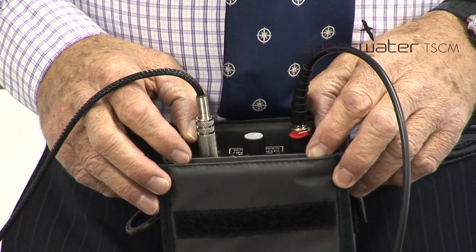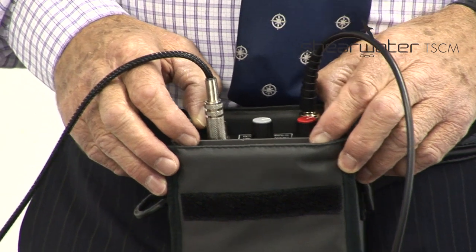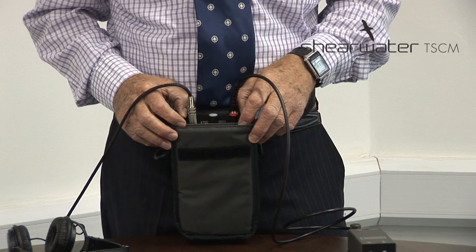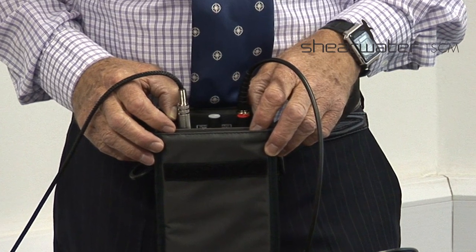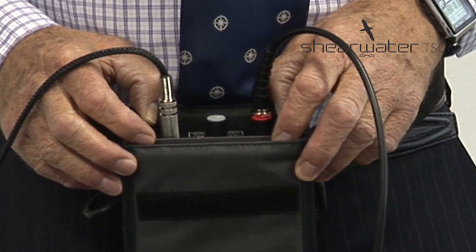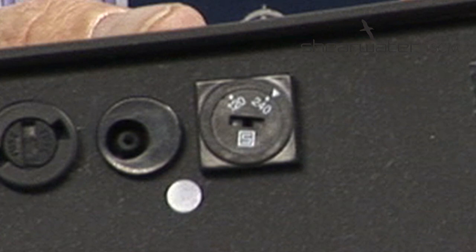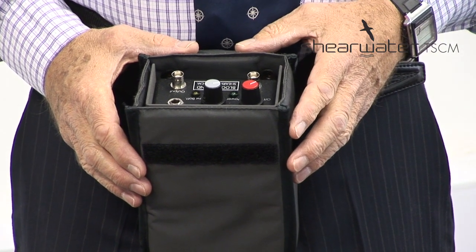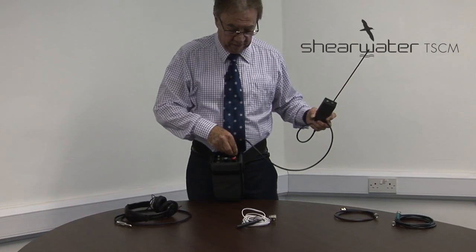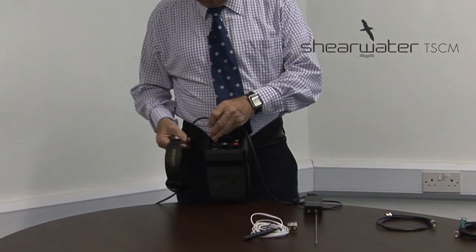We are endeavouring to detect the radiation emanating from the microphone wiring, which is a very low level signal. Unfortunately, the radiation from mains electrical wiring common in most search areas is at a high level and can readily mask the weaker signals we're searching for. The purpose of the filter is to reduce the interference from the mains wiring. It can be preset to either 110 volts 60 hertz systems, common in the Americas and Japan, or 50 hertz 240 volt systems used in the rest of the world. The filter can be conveniently worn around the waist. We connect the probe assembly to the input of the filter and the screened headset to the output of the filter.